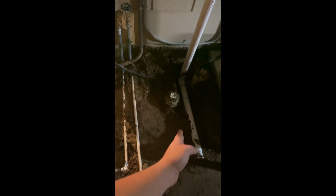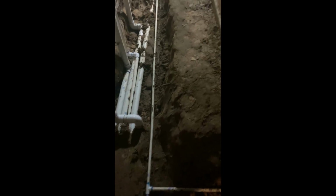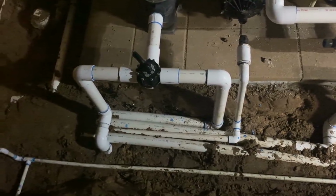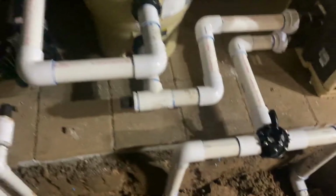But rerouted the blower motor so it'll be up here underneath the overhang, a little bit more protected from the elements. Came off all new plumbing across from where it was cut, right about even with that washout roughly. All new plumbing over, and then skimmer basket in the main drains at the bottom, into the motor, filter, out of the filter.